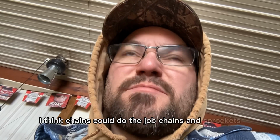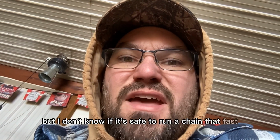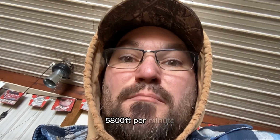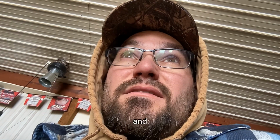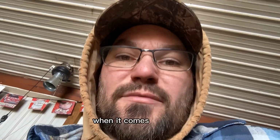I think chains could do the job, chains and sprockets, but I don't know if it's safe to run a chain that fast. I think I've calculated like 5,800 feet per minute. That's a mile a minute, or 60 miles an hour. In, you know, a number 40 chain right at my feet or legs. You know, safeties can block that when it comes apart, but yeah.